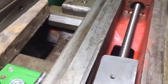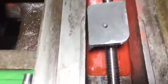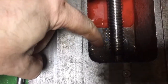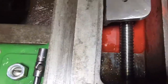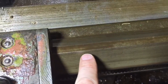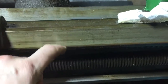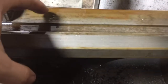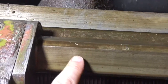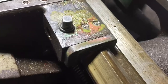So why was I going to go mad and try to get as much travel as I could? Well, down this hole here is where I would have liked to shave some metal off for it to run in. But I can't, because directly below that is the V-shaped part of the prismatic bed. This is absolutely key — the whole lathe function revolves around this raised part here. There's one on the other side just for the tailstock, but this running surface here with the seals on it is the critical bit, and there's no way I'm going anywhere near that with a grinder.